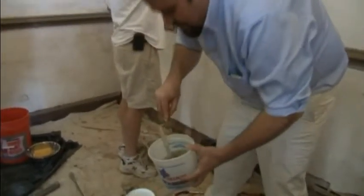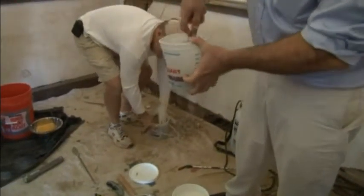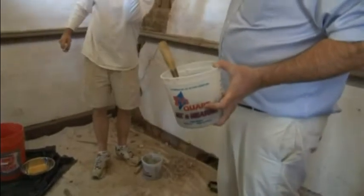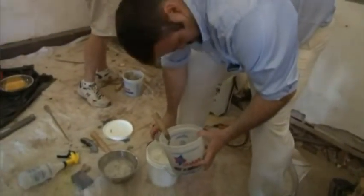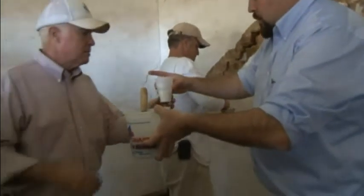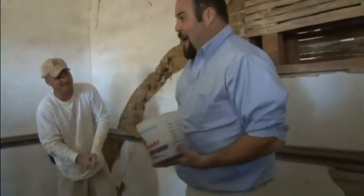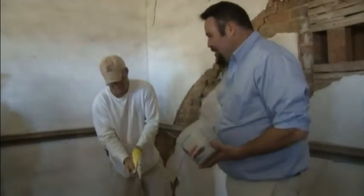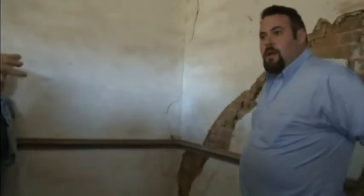You can all see how dry and crumbly this mix is. So we're going to add our special casein. Come here and take a look because I don't do casein grouts very often. These types of cracks — the way I would probably approach it is more like just putting mortar in here. One thing we'd want to do is find some brick slivers and work those in as well so we don't have a huge body of mortar in there — you want to keep the amount of mortar in the hole relatively small.